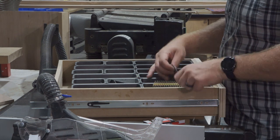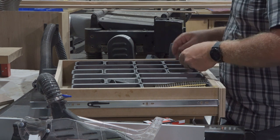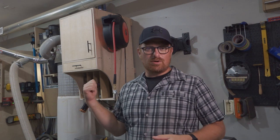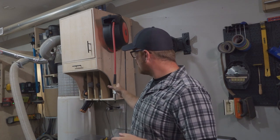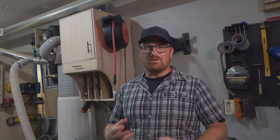I'm also really happy that I incorporated a drawer to store all my pneumatic nails and air tool accessories. I used some bins left over from Husky tool bins that I didn't end up using as foam tool holders — they make nice organizers for the drawer and I actually kind of built the drawer around that. If you want, you could 3D print those or just buy some plastic tool organizers on Amazon. I used three-quarter inch MDF as the separators for the different nailers, using super glue to connect the top end since I couldn't easily drive a screw or nail. I wanted these shelves to be easily removable and changeable if I ever wanted to add more nailers or change the setup.